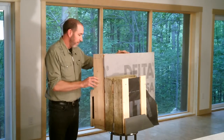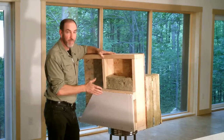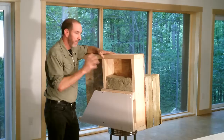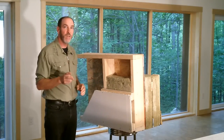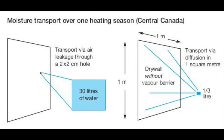Normally people are used to seeing a normal 2x6 wall with insulation in the stud cavities, a poly vapor barrier, strapping maybe, and then drywall. That vapor barrier is acting in two roles — it's your air barrier but also your vapor barrier. Those are two very specific jobs. Vapor diffusion is moisture absorbing into the wall and drying through to the other side — that's what the vapor barrier stops. Air barriers, on the other hand, are tasked with stopping air leakage through individual holes. A lot more moisture is deposited in your walls due to air leakage than vapor diffusion.